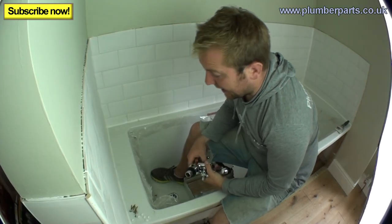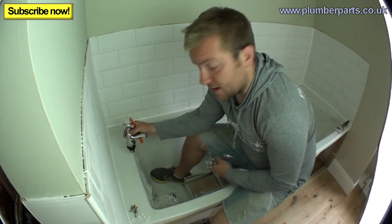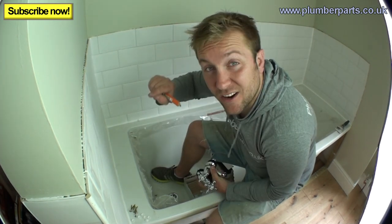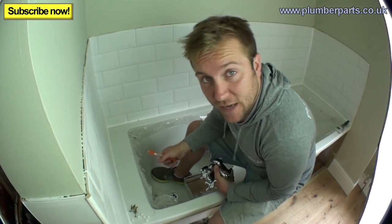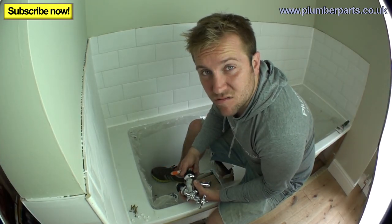So this is the bath we're on about here. Always put your cold tap on the right-hand side and your hot tap on the left-hand side, obviously. Then you'd use a standard hole cutter to cut two neat holes in, and then you've got the positions for your taps. Let's have a look at how we're going to do that — it's going to be great.